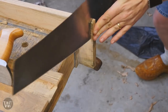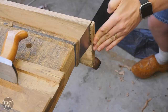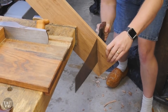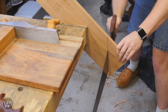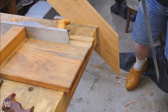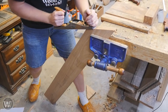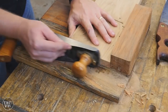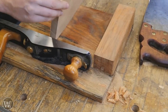Then we need to cut it to the exact length. Because I rough cut them earlier, now we need to give them an exact final cut. On the top boards, those are going to have a 45-degree angle, so I can chop those up in the vise and cut them down. I'm really not trying to be deadly accurate because I'm going to come back through with a plane and clean them up. With the 45-degree, I'll quickly run down the edge until I get a nice clean edge. Then with everything with a straight edge, I can put it in the shooting board and clean them up, leaving a really nice clean edge for the next work.